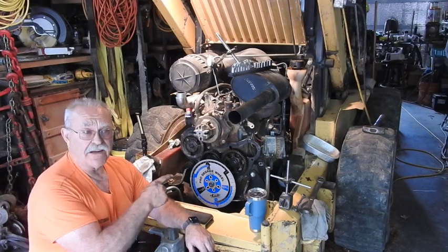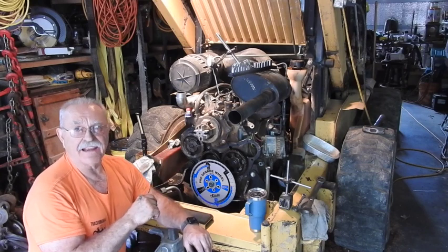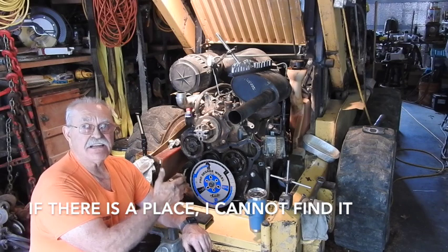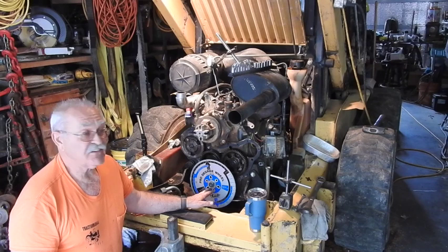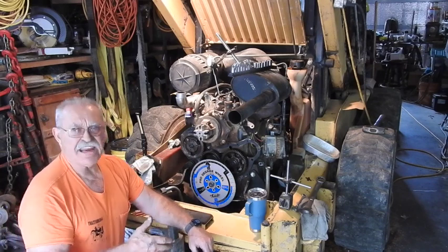The other inspection plate opens up a little compartment that shows you the tail end of the rear cam bearing. There's absolutely no place on this machine to easily see the flywheel marks to set the timing. That's why I'm going through the trouble of putting the degree wheel on the crankshaft—I've got no timing marks accessible without another day's worth of work.